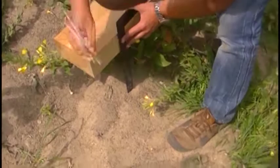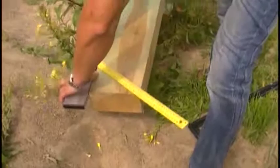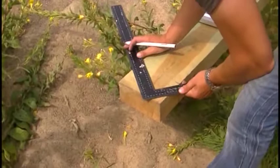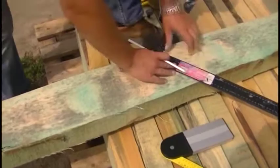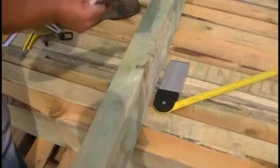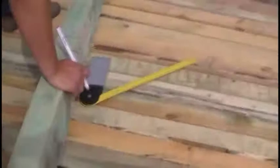In the case of the simple gable roof, the matter is much easier, because in that case all the rafters are equal. We also have no hip rafters. We don't have any heavy or complicated structure as in this case. So the gabled roof building is much faster and easier. However, this roof includes in its design a lot of interesting structures that have teaching value. It is very important for us to have all the rafters numbered in order to not confuse anything while assembling. And after drawing, proceed to cut, then planing and smoothing the overhangs.